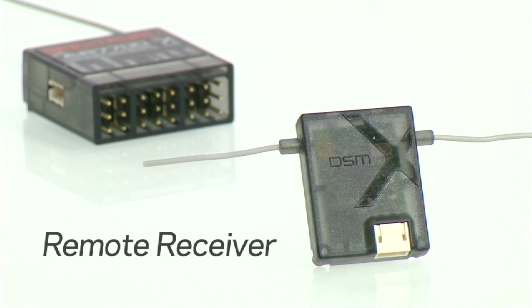Sure, if there's a flight controller in your airplane — for instance, I have an FPV airplane set up with the Eagle Tree Vector and I'm using PPM out of the 7700 — it really cleans up the wiring considerably and opens up a few more options that wouldn't be available with a conventional servo signal. The 7700 can also work with or without the included remote receiver, which gives you flexibility: if you're flying a small course with a quad racer you'll never have a range problem and can keep weight stripped down, using the coax antenna to get optimal antenna position without necessarily needing the diversity.